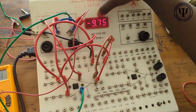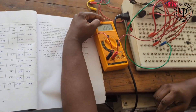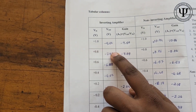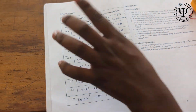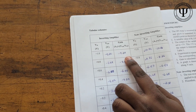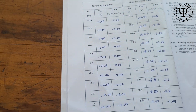The output we are getting is minus 9.75. The minus sign is very important — please note it. That is how the inverting terminal occurs. The multimeter reading is around 1.05 volts, so we write it as V in. The V out which we get through our DVM is minus 9.74. Please write it with its sign. So the gain AV = V out / V in = minus 9.74 / 1 = minus 9.74.